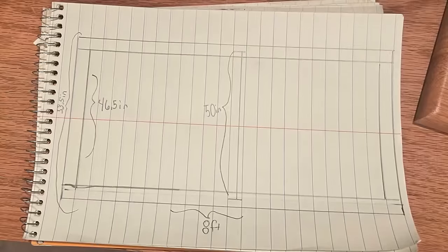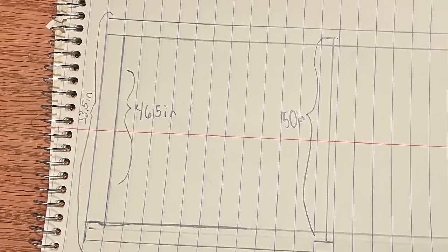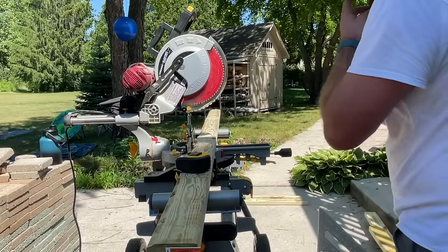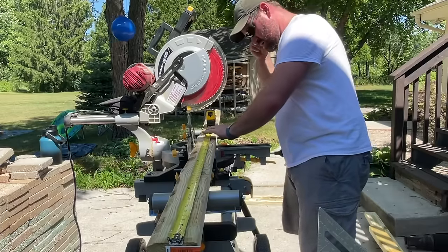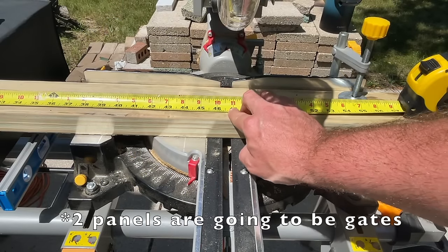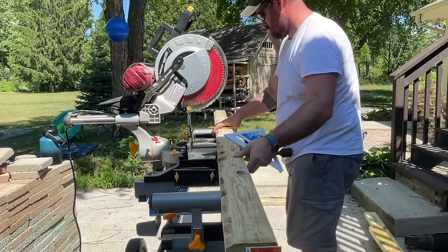For the center spacing, we need two boards on either side that are going to be 46.5 inches. That gives us the exact dimensions of our outer panel that we can attach our fence to. To create the assembly line, we're going to cut all of our boards to 46.5 inches. We'll end up needing 16 of these panels, because two of the other panels are going to be gates. So first up, we'll cut all of our center boards to 46.5 inches and work from there.